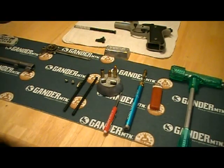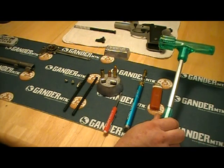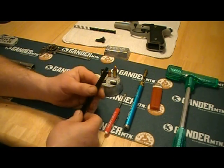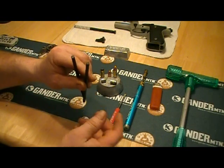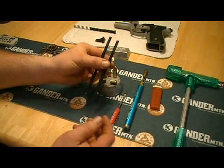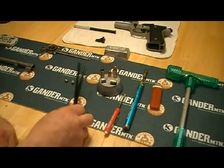We're at our worktop. I'm going to go over a couple of the items that you're going to need in order to slug your barrel. The method I'm using is pretty basic. You'll need a kinetic bullet puller to drive the slug out of the fired case, a small torch to heat your lead up, a small pocket screwdriver, and a dowel rod. Everybody I've seen has been using wood dowels. I didn't have any in the house, so I found a fiberglass rod — something like a yard sign stake. I ground it down with a bench grinder, and I'm actually happy because it has a lot of virtue over wood. It won't mar your barrel, yet it's got a lot more strength than a dowel rod, so you don't have to worry about it busting off and lodging up with the lead slug inside your barrel.